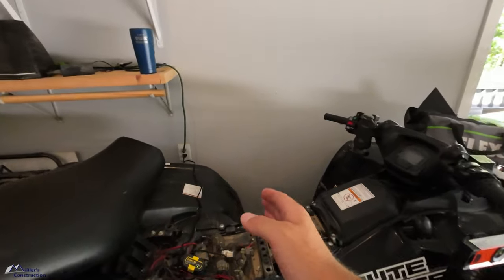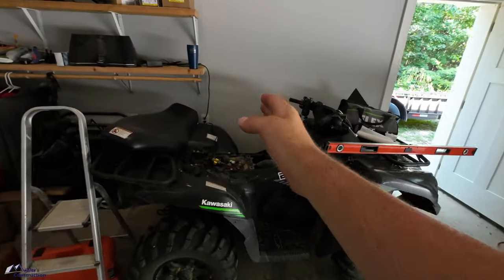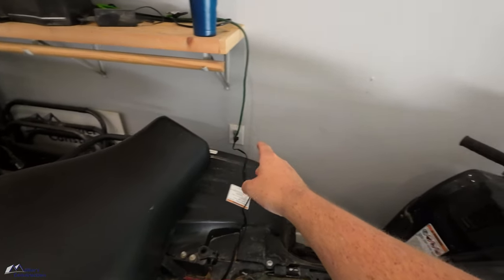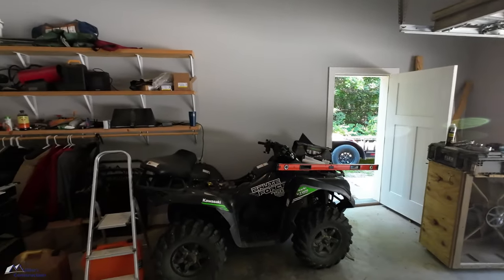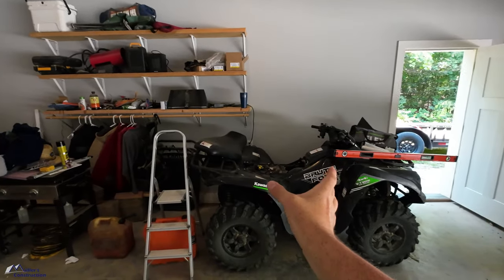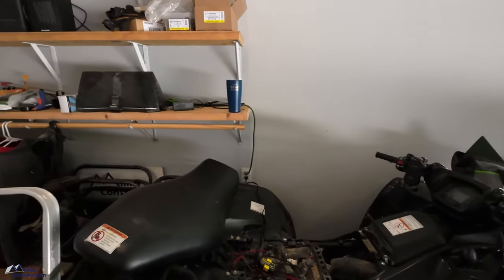This is the center of the garage. It's 28 foot. That's the center. I have a stud over here that this receptacle is attached to, and I have a stud right here. You can see where I've mounted something previously. That's the center of this garage on the outside wall. I want to put a ductless head right up there, and I'm thinking about chopping out that one section of drywall, taking out that insulation.